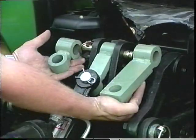Note, each hydraulic top link comes with a ball joint on the rod end of the cylinder and a removable knuckle connector that comes in 2-inch, 4-inch, and 6-inch lengths. This allows the hydraulic top link to have the proper movement toward the tractor and away from the tractor when the male Jiffy Hitch is vertical with the ground.